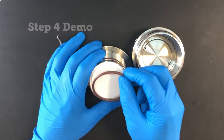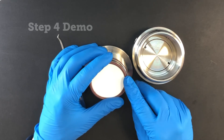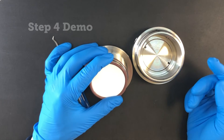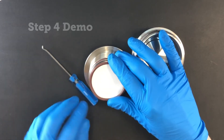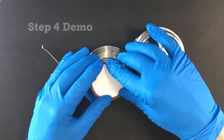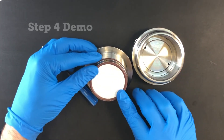Next, place the o-ring over the membrane, centering it over the o-ring groove, and lightly press one side of the o-ring into its groove. Repeat this step on the side directly opposite. Once those spots are pressed in, repeat those steps for the spaces in between on alternating sides so that the o-ring and membrane are firmly pressed into the groove.